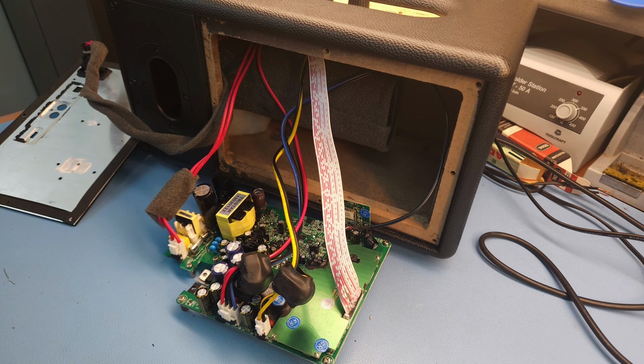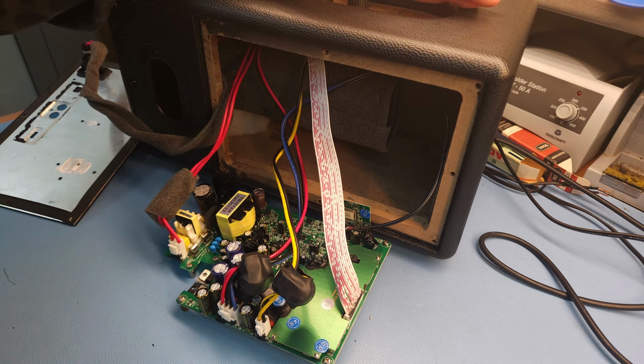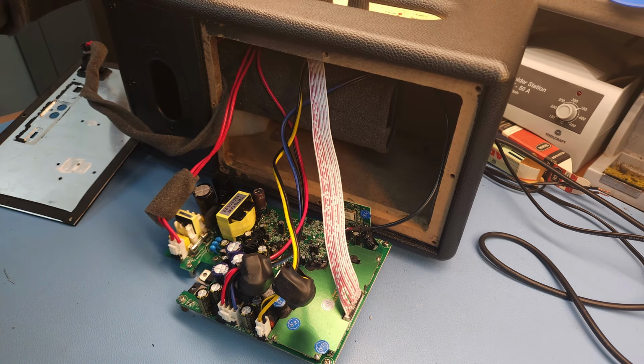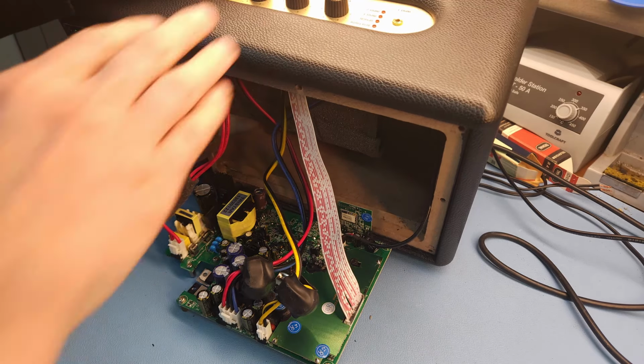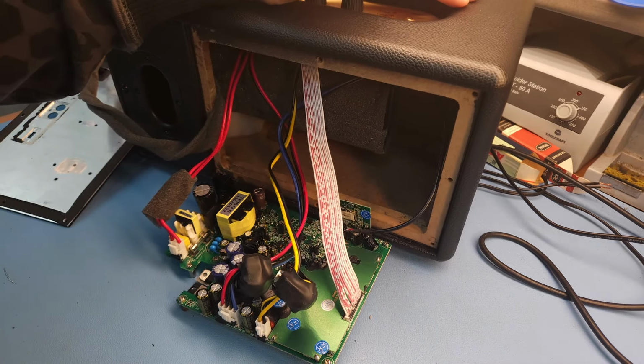Okay, I just powered up the dim bulb. Let's fire up the speaker. Do I have everything connected correctly? Yes. Let's fire it up. Okay, the dim bulb lit up very brightly for a second and then dimmed off. It's drawing 9 watts, 70 milliamp, and it's only getting 200 volt, but it is powering up. The Bluetooth LED, you cannot see this on the video, maybe over there, see that the Bluetooth LED is flashing, so we do have power.